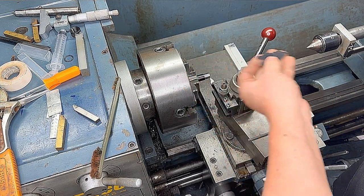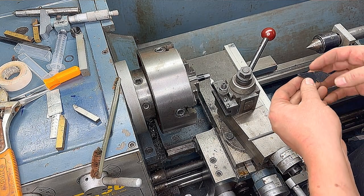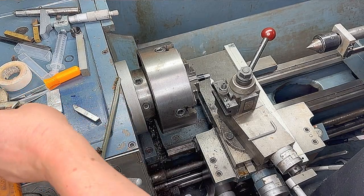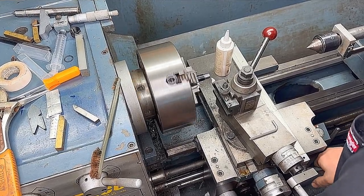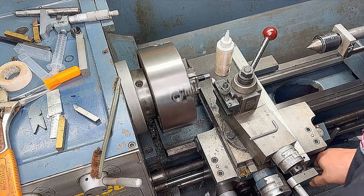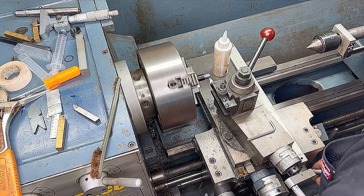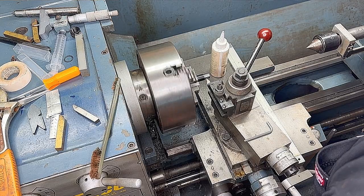The bit needs to be parallel with the barrel so that it will cut straight in. There wasn't enough room to put it on the barrel itself, so we used the edge of the live center to align the bit. We've gone ahead and set up the lathe speed to 60 RPMs, which is about the slowest that mine will go, and set our DRO for the major diameter of the threads so that as we cut we can move in a couple thousandths at a time and know when we get to the depth we need, just taking light cuts.